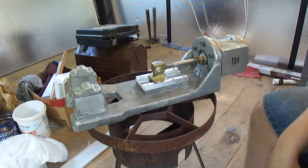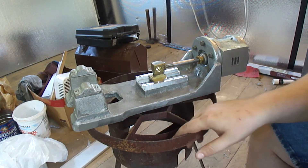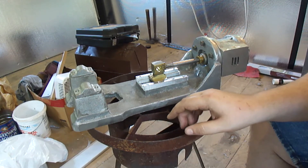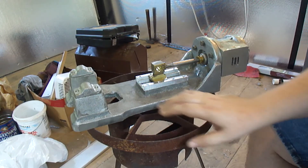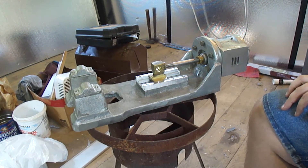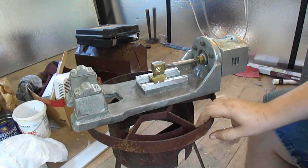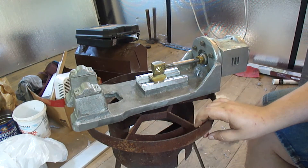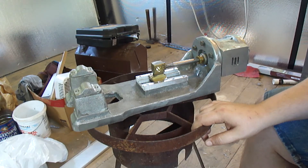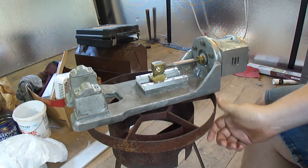From then I'll probably melt down and cast some bearing cap blanks for this thing out of gun metal, because I have more than a little bit of it. I was thinking about getting either phosphor bronze — overseas it's C932 bronze, or in the US it's SAE 660 — it's just leaded bronze. I've also been looking into it for my lathe to rebuild the headstock bushings.